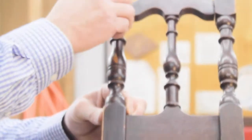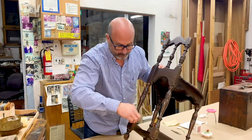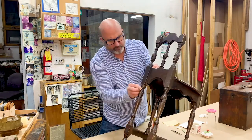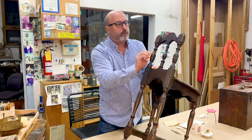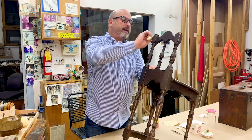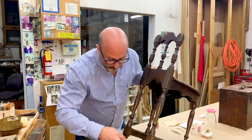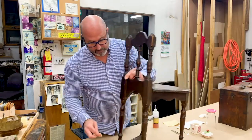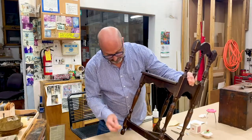This is reviving and reconditioning an original surface. Reading the comparable product literature, it says compatible with any wood surface — but people get confused and think of bare wood. The surface is going to have a different coating, so it's compatible with shellac, lacquer, varnish, polyurethane, and oil finishes.